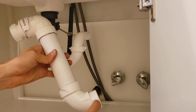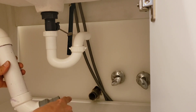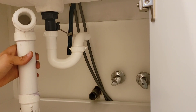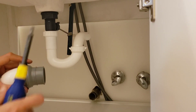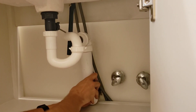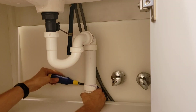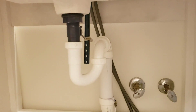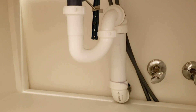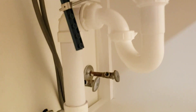Here's the piece of PVC all glued together — it's got the 90-degree bend with the male-to-female connection. The male connection goes on with hose clamps onto the copper pipe in the back, and the top has the male connector that goes onto the standard bathroom drain pipe. I'll attach and tighten the hose clamps, slip it over the copper pipe in the back, and slip the one-and-a-quarter inch bathroom plumbing fitting into here. Here's the final result — it leaves a lot of usable space in the cabinet, it's all attached and glued up, and I think it's a really clean install.